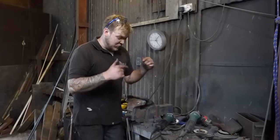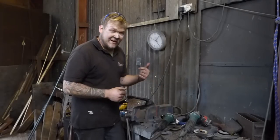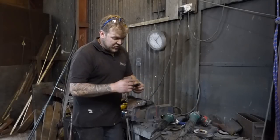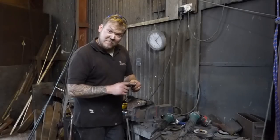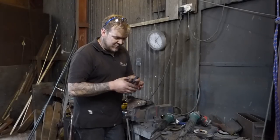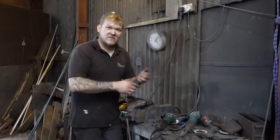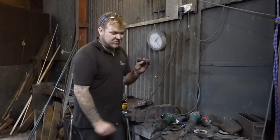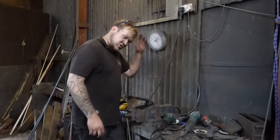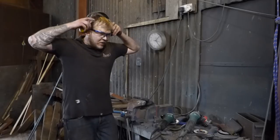We've allowed these to normalise now. What I'm going to do is start grinding up the faces. I'm going to use an angle grinder for this — I don't have any other facilities for grinding. I'm going to grind two sides: the impact side, which I'm going to bring to a little bit of a dome because domes allow us when we strike at funny angles to drive the impact straighter, and also just tidy up these faces. I suggest you wear a mask and protect your eyes and ears — if you don't, it's not my fault.